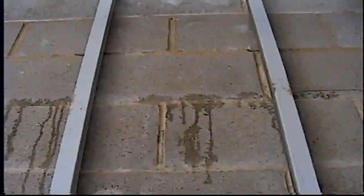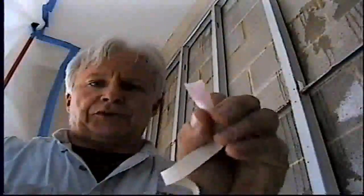This is going to the wall of the unit below. Now we're getting that signature pattern where a whole bunch of leaks drip out of a single mortar joint. Maybe the cores are filled solid, but it's very noticeable. Eight minutes into the testing, there are leaks all over the wall. This is water indicator tape — it turns purple when you wet it. I want to give you a graphic demonstration of how much water is in this wall.